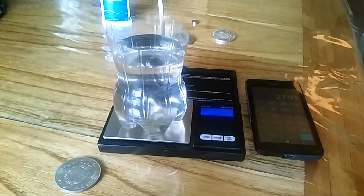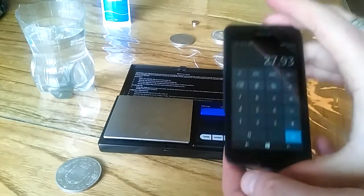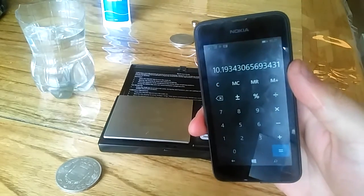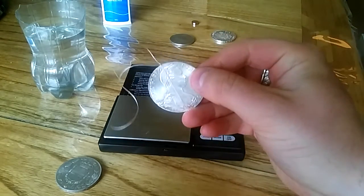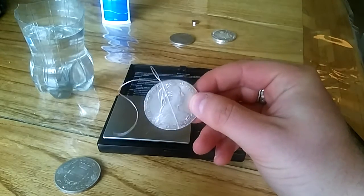Take it out. You might notice when you take it out the scales aren't zero — that's because there's water left on the coin; you can see a drop coming off. Don't worry, your scales aren't wrong, it's just that you're taking some water out of the cup. So once you've got your result of 2.74, you just divide the original weight by the weight of it in water, 2.74, and we get 10.19 — pretty close to 10.2, which is exactly what it was meant to be. So that's pretty conclusive proof that this supposedly fake coin, which I got as part of a lot of four coins for £1.99, is real silver.